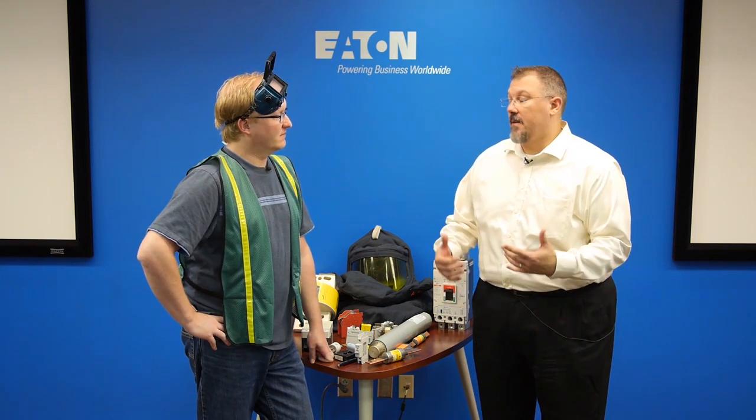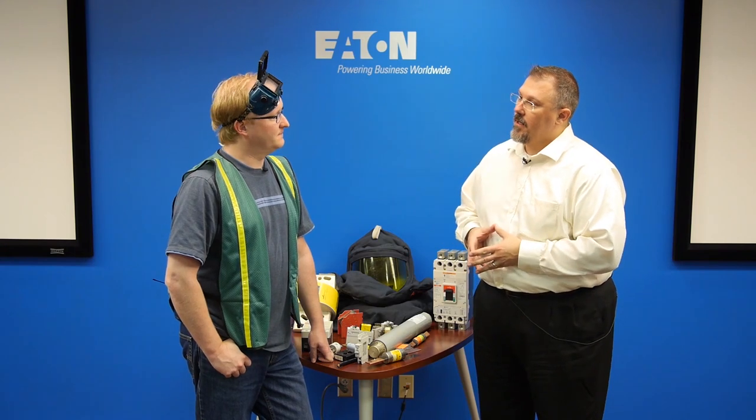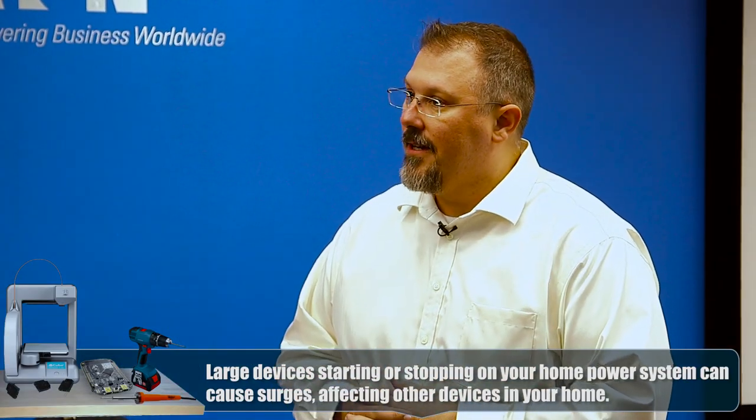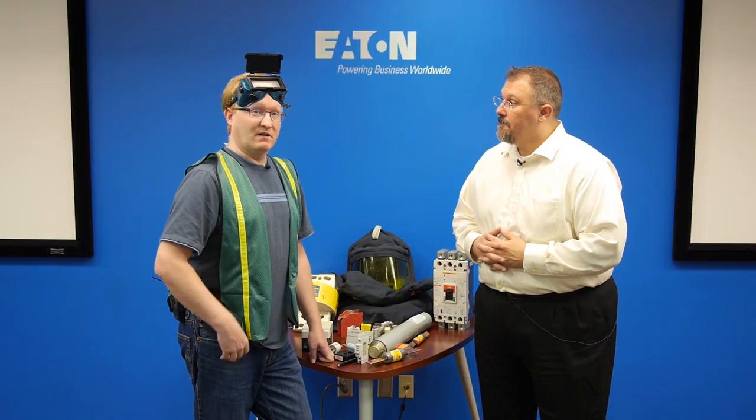So far we've seen an arc flash event and a wire whip. What other electrical problems needing protection should we think about? We should always think about surge. I've heard of surge protectors and seen them in stores — tell me more. Surge protective devices help protect sensitive electronic equipment like stereo systems and safety equipment like smoke detectors. They all have microprocessor-driven boards. Years ago we didn't have electronics at home, but today we do, so they're much more sensitive to power surges from a utility or even from within the facility or your home.